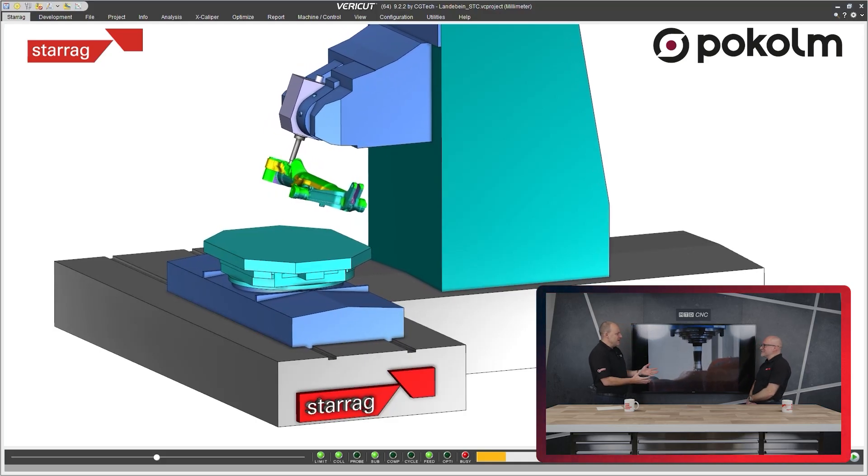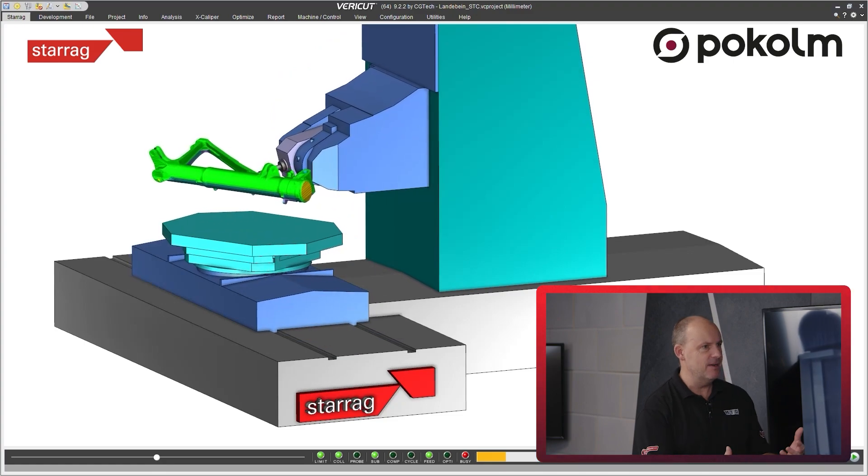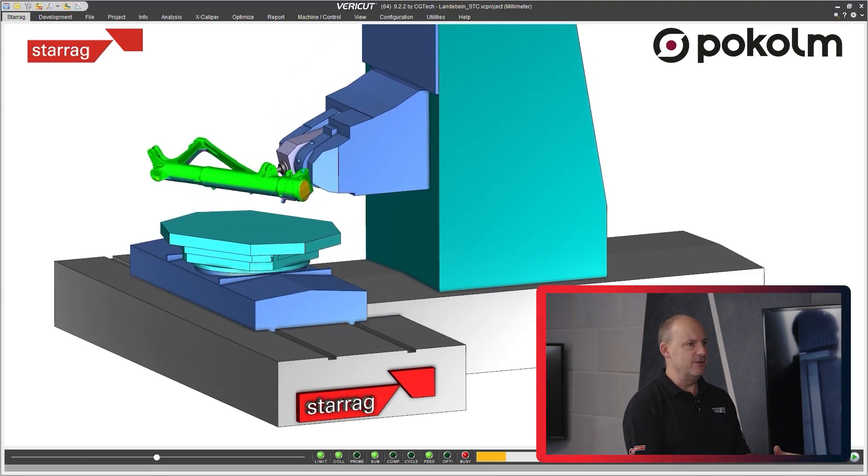They design it in the best way for the aircraft to handle a landing - they don't worry about how you're going to make it. When you take the ones I've seen, they look like they're turned, but they're milled as well - the interpolation. How do you keep the concentricity and all of those precision elements? Well, some of them are turned. If you've got a landing gear that's basically a tubular type shape, you'd put that on a mill-turn type machine. But as soon as you get a leg sticking out and you can't rotate it effectively on a lathe, it has to be milled. It's almost like a mould and die type job - a button mill profiling type job with some five-axis. And to make it pay in a single setup, you've then got to get round and put the holes in at very accurate positions, very tight tolerances, often with quite complex hole features - multi-diameter, undercuts, all that sort of stuff.